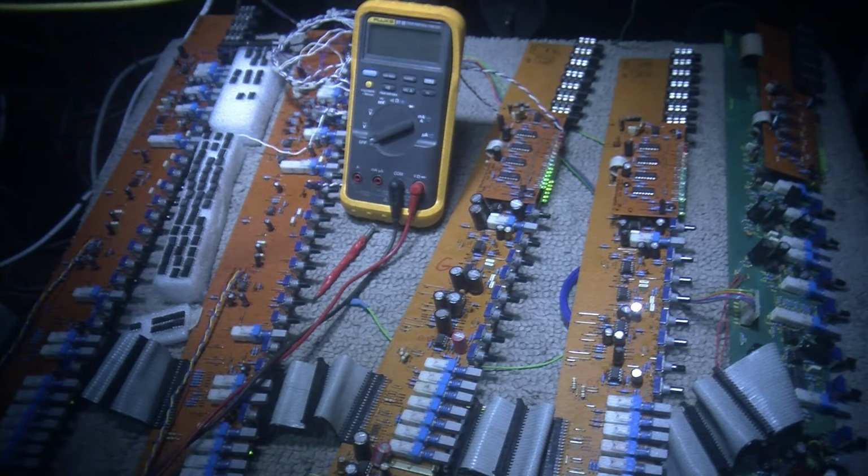I'm telling you right now that a lot of the noise was caused by dirty faders. And once I clean the fader, the channel becomes quiet. And so it's pretty good. I don't know how old this board is, maybe 15, 20 years old, but it's pretty quiet. It's nice and quiet actually.